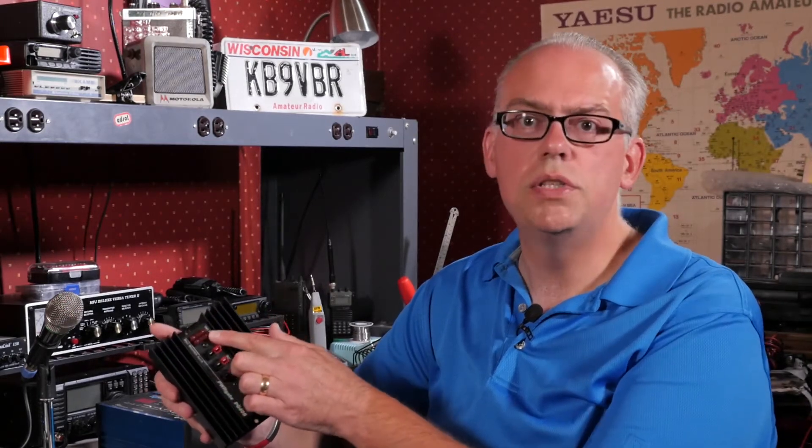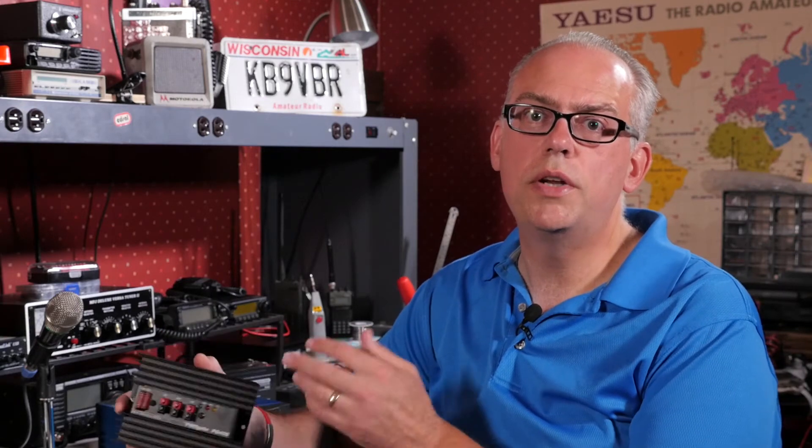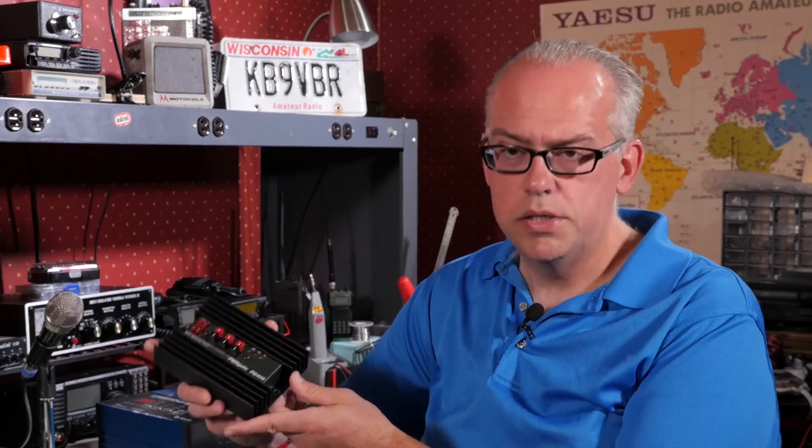It has various different charge rates. You adjust the little fuses on the front panel and you can pick a charge rate of 1, 4, 7, or 10 amps. Three indicator lights on the front: a power light, a peak charge light that indicates fast charge mode, and a floating charge light for the start and end of the charge cycle. Once your battery is peak charged, it goes into maintainer mode. There are three connectors: one to connect your station power supply, one output to your radio or distribution block, and one that runs to the battery.